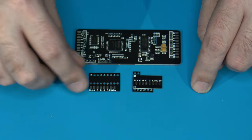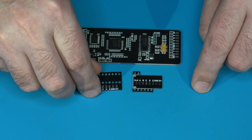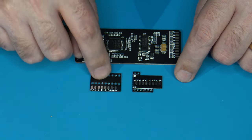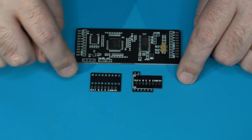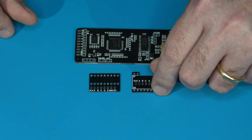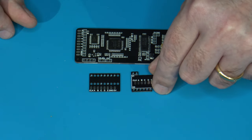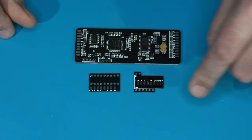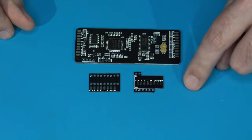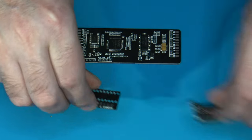This board over here is actually for attaching to the bottom pins of the color chip, U10. And then it provides the video, in addition to power and ground and the clock signals we need, and runs them to pads here. This QSB over here that has the 21 and the 20 on it, marking the pins, is actually for use if you would rather take those signals off of the STIC IC chip itself, which is one of the main graphics chips in the Intellivision console. But that's what their purpose is for.